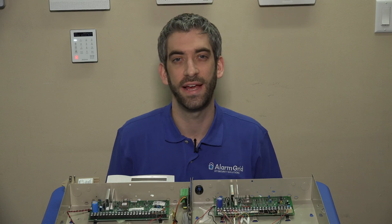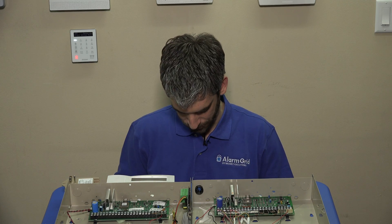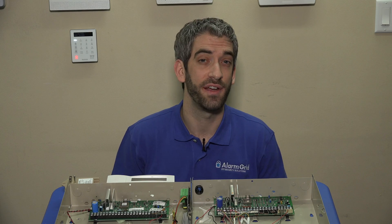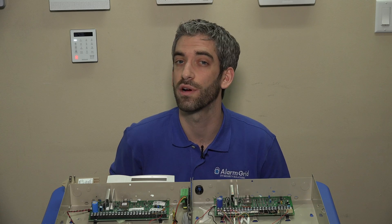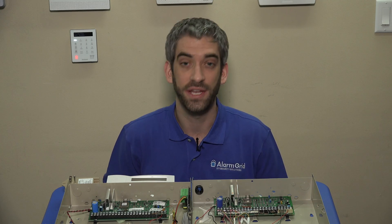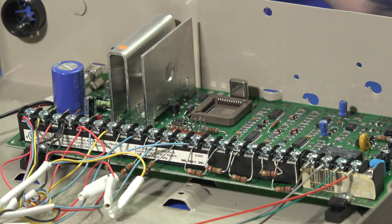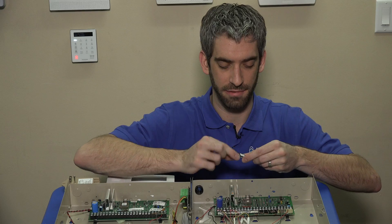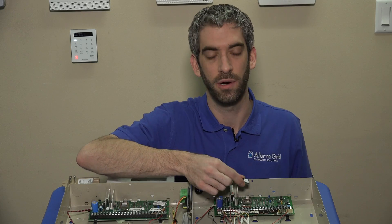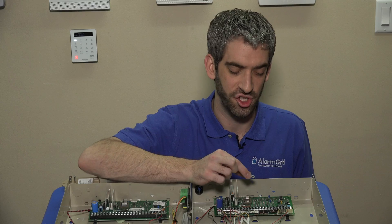To do Total Connect you need a 20P-912 or higher. Because we are not an ADT company and we're looking to get Total Connect service — which doesn't work with an ADT system — you need to use a traditional Honeywell PROM. Now that we've removed our PROM, we're going to locate our new non-branded Honeywell PROM. So instead of the WA-3000 or WA-3001, now we have a chip that says WA-20P-912.